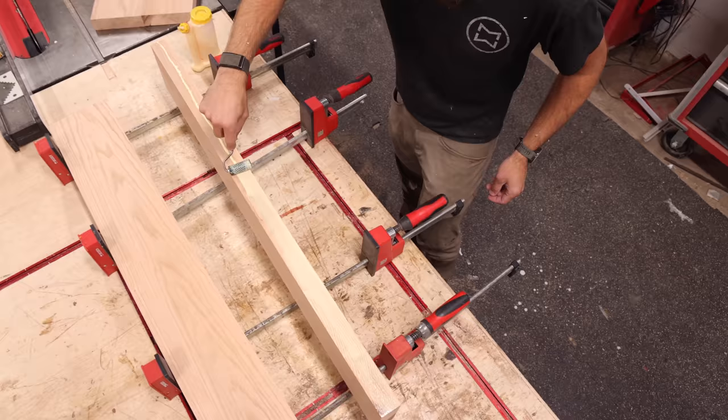We're gonna go with a Nakashima-style table, which I absolutely love. I used to do a ton of live edge furniture and it's in that fashion — some live edge breakdown as well as construction all from the same slab. I've got a walnut slab here — it's called a crotch, no dirty jokes — and I want that to be the focus on the top. Nakashima typically uses a lot of figured woods. I like to make my tables around 40 inches on top, so I'm gonna make a line here at 42 from that end, find my center, then get to flattening.